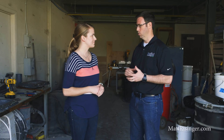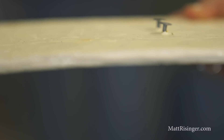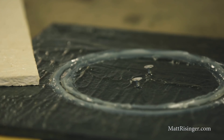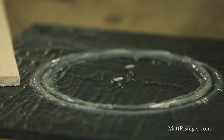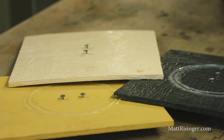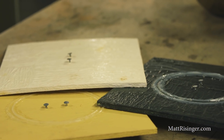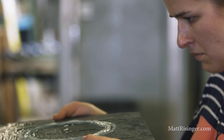So how does the test get performed? Basically, you have a half-inch sheet of plywood and you cover that plywood with whatever membrane you have, then you drive two nails into the membrane and back them up a quarter of an inch. After that's completed, you cut the bottom out of a one-gallon paint can and seal it with silicone on top. Then you put five inches of water in there — so you've got a nail with five inches of water over the top of it, and the fastener on the nail is not tight against the membrane because it's been backed up a little bit.